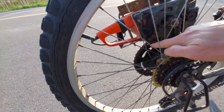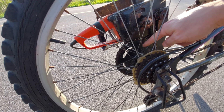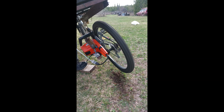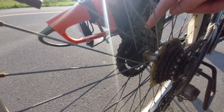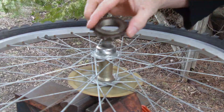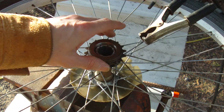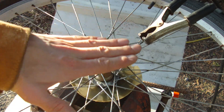I've taken a sprocket from another bike — the one on our pedal — cut it to size, welded on a piece of eighth-inch plate, and drilled four holes. It's bolted to a regular 410 freewheel sprocket. The freewheel sprocket is welded onto the hub, the sprocket's on the right way, and I've got it true so it doesn't wobble. I ground down the hub as deep as I could.